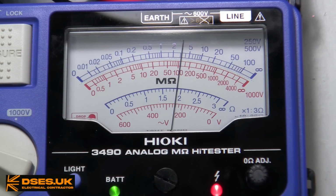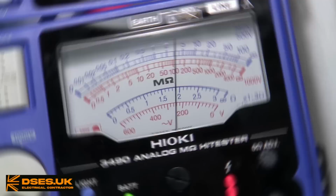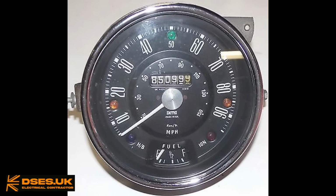Back when I was a student at Coventry Technical College in 1991, I was assigned a project to describe how an analogue vehicle speedometer works. It turned out to be rather interesting. I sourced the speedo out of an old 70s Mini from the scrapyard and observed that the mileage readings weren't linearly spaced throughout. To account for mechanical variances at lower speeds, the markings were spaced closer together, as you can see on this image, where the gap between 0 and 10 is smaller than the gap between 10 and 20. There was also the pin, which stopped the pointer moving anti-clockwise when reversing.